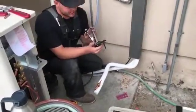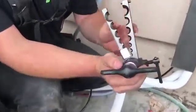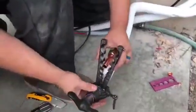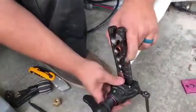Now with our Black Max flaring tool, you've got all your gauges, all your different sized coppers, and you've got your little slide gate. This is 5/8" copper, so I'm going to get it into the 5/8" port.